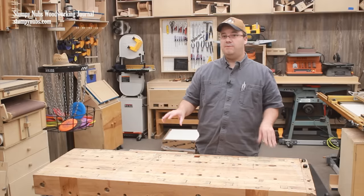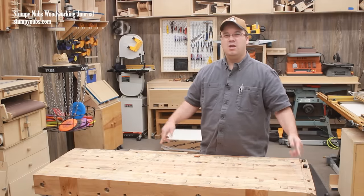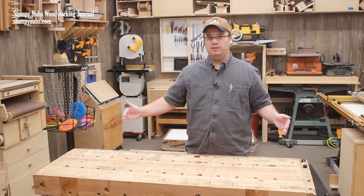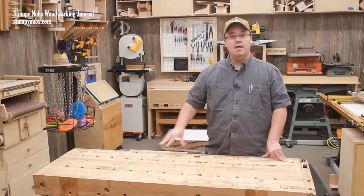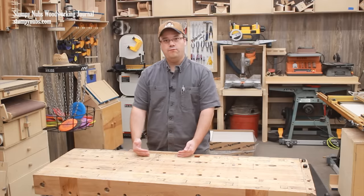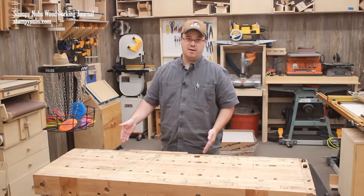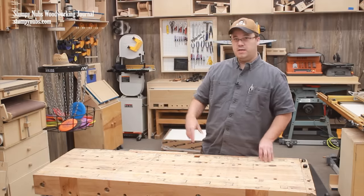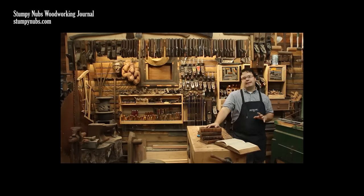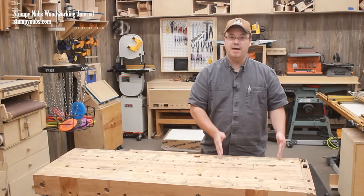There are some minor changes I would make if I were to build this bench again, particularly the length and the position of the two vises. I built this bench for the space I had at that time, which wasn't a lot, so it's only five feet long. An extra foot sure would have been nice — that would have given me more work area besides this face vise. It's a little bit of a pain to be reaching over the vise when I just want to work on top of the bench. This vise is sort of misplaced in the middle of the bench top anyway. If you're right-handed like I am, the end vise should be on the right end of the bench and the face vise nearer to the left, not here in the middle.